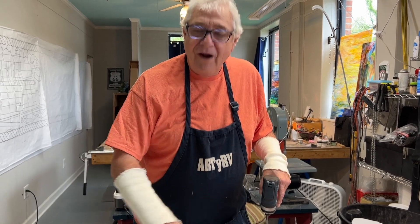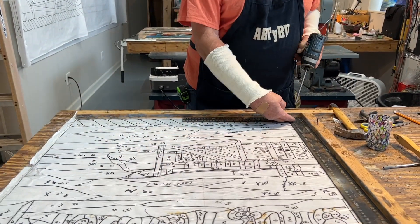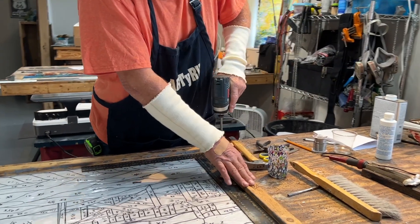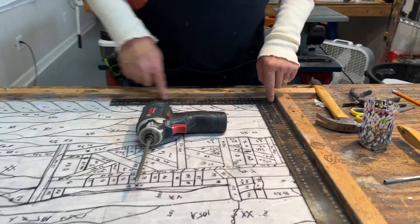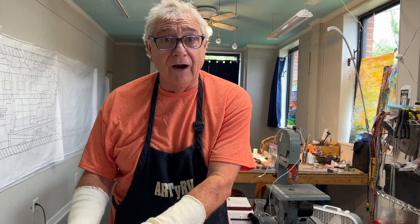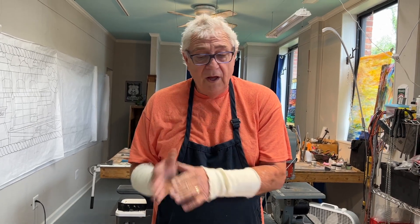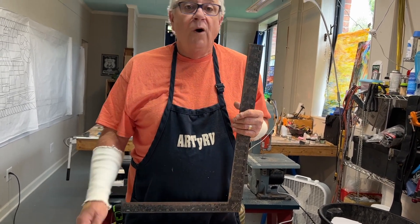I start on this corner and I work my way all the way to this corner, going just like this — all the way bottom to top at the diagonal. So let's get this piece of channel laid down so it doesn't move so we can get this process started. Our square is exactly where it needs to be. If you start out square it usually finishes up square. If you start out not square it gets worse and worse as you go on. So be very careful. Just a small framing square like this gets your windows started, and now we're gonna move on — I'm gonna show you how to stretch some lead.